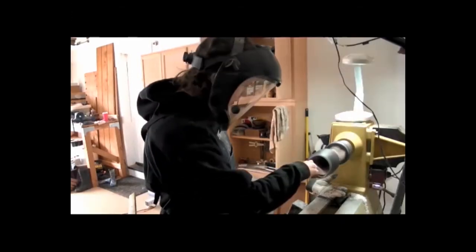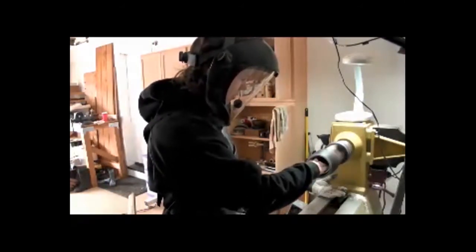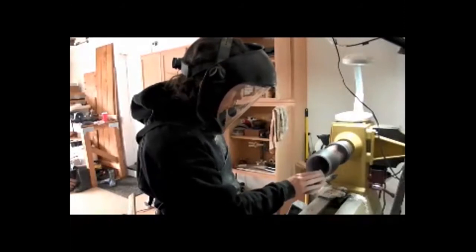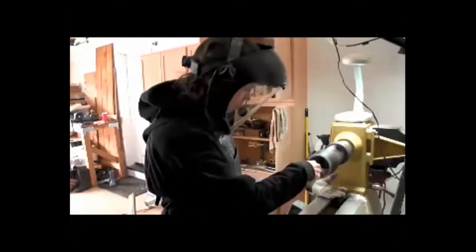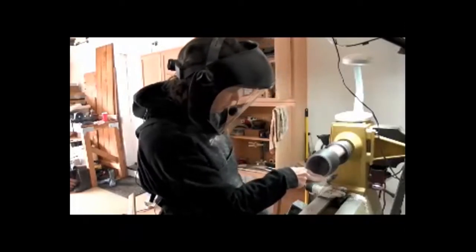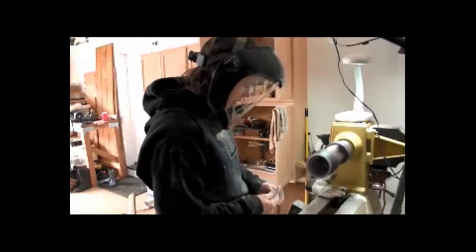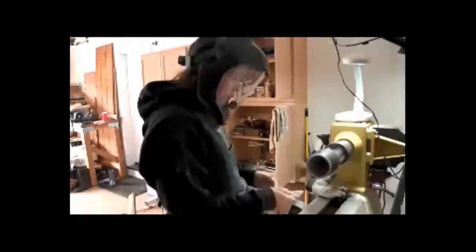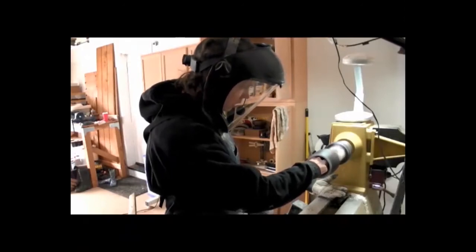The way you can see it coming together, and I'm only at 120 grit, is just so exciting. Each stage of it gets you closer and closer, and you just take that time to put in the finished product. You really don't need to push hard. That's something that I learned probably many times the hard way. You push hard and you start to burn. That's not the point of sanding, obviously, to most people probably, but I was under the impression when I first started that the harder you push, the more pressure you give it, the better it's going to be.